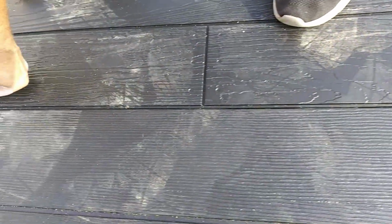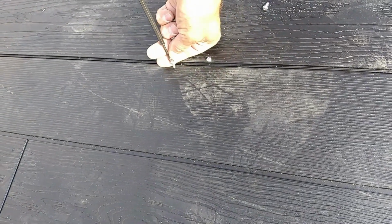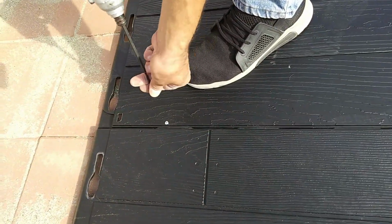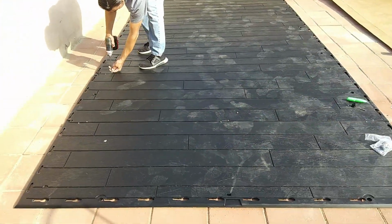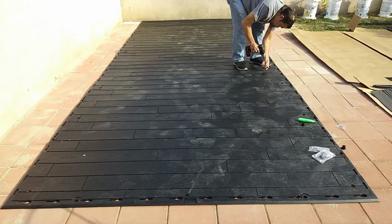And you have 2 on the outer edges, 2 in the middle, and 2 on the other outer edge, all the way across each connection. And there's 2 little dent marks. You'll see the little dent marks. I don't know if you could zoom in there, but you could see a little bit where the dent marks are. And you just put screws where all these little indentations are, along your middle spline and your 2 outside edges spline.